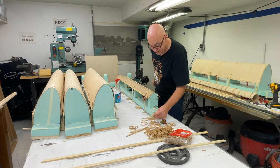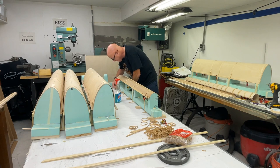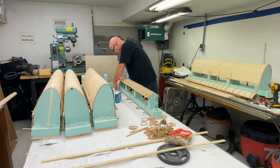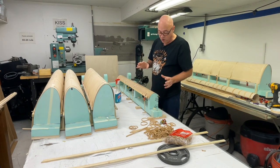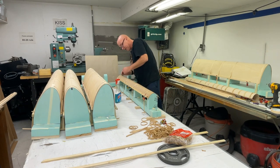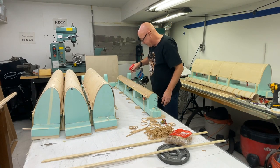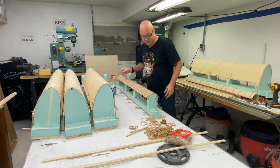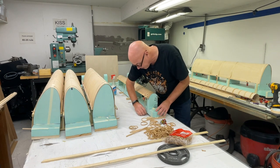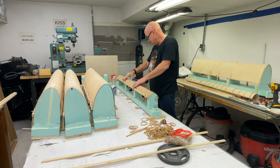If I was going to mass produce these, I would set this up completely differently. But I'm only going to build one set of wings — left and right. One thing I discovered: on day one I gave the skin a long time to sit, but I've pretty much figured out you don't have to let it sit. As much as you've soaked the wood, once you get the shape started like this, you can go ahead and start torquing down more rubber bands. This one needs to be closer to the tip — I got that one in too far.